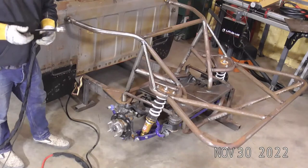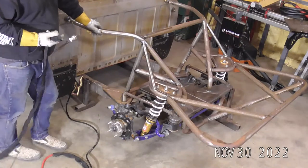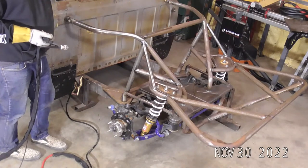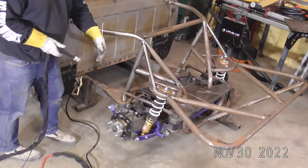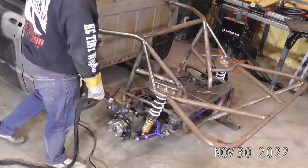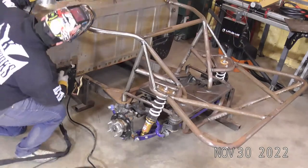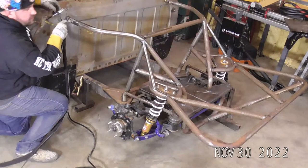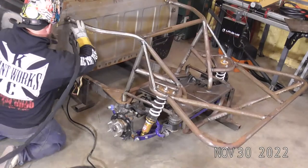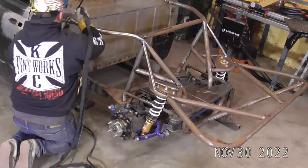And that comes from the high frequency, especially with TIG. That comes from the high frequency of the start, or like if you're doing aluminum welding, like you're welding up a tank or something like that inside the car, the high frequency can mess with some of the real sensitive electronics. So there's some people that say you don't have to, and it's just a wives' tale, but I'd rather be safe than sorry. So I always go ahead and disconnect the battery on any car or truck I'm working on.